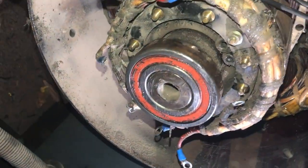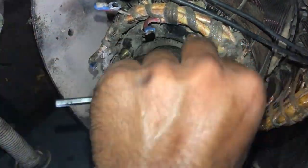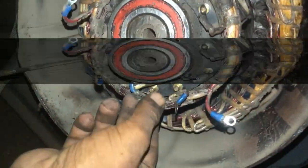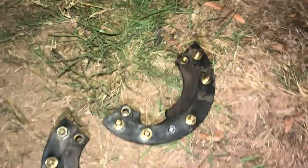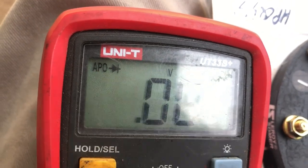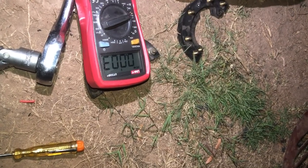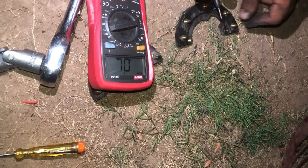Now I am going to tell you about the working of the bridge rectifier. The bridge rectifier converts AC current to DC current. Alternating current has a frequency of 50 to 60 hertz depending on your country. On conversion to DC the frequency drops down to zero. The frequency has positive and negative half cycles. During the positive half cycle, the positive diodes are in conducting state while the negative diodes are in non-conducting state. Similarly, during the negative half cycle, the negative diodes are conducting while the positive diodes are non-conducting.